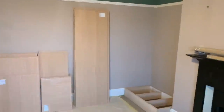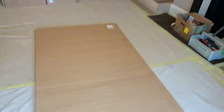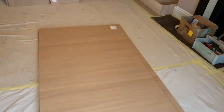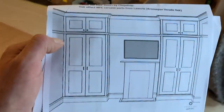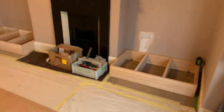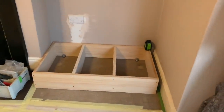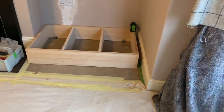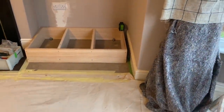We've carried all the boards up so I'm slightly out of breath. Brady will be assembling them using the back panels as a sort of flat workbench to start assembling the frames — that'll be the two lower units which are split off first. While he's doing that I'll be leveling these plinths, which are heftier than normal because they want to go up to the skirting height — we're going to wrap that seven or nine inch torus skirting round.